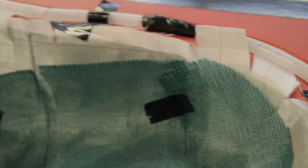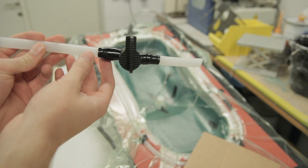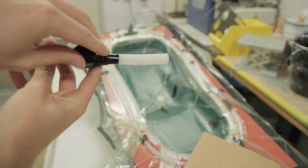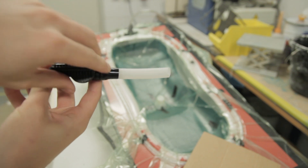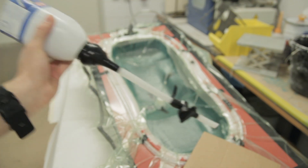Here is a little improvement I made compared to previous videos. As you can see, the spiral tube around the parts is laid on top of the peel ply, which creates a barrier preventing the resin from going through very fast into the catch pot. Here is my infusion line. I see a lot of guys adding cups or pots around the infused part with a hose connected into it, but here's my little tip: I'm using this by opening the little connector so resin will flow through, or it can be stopped.